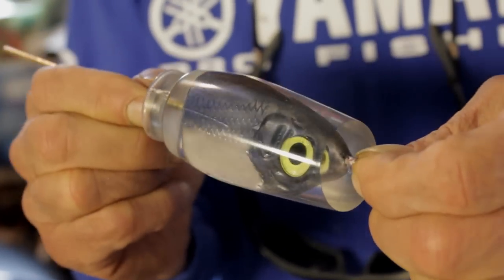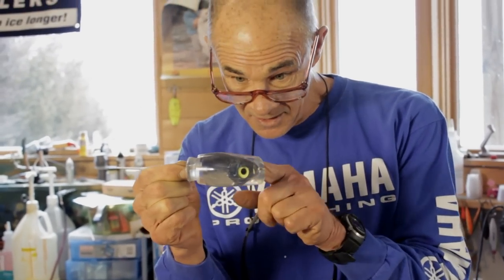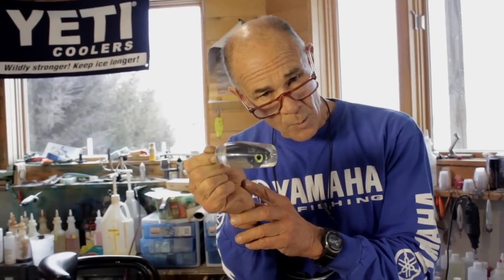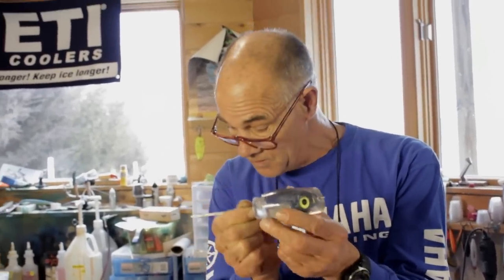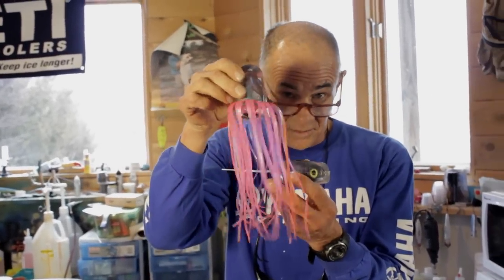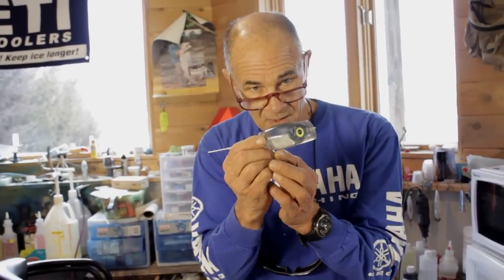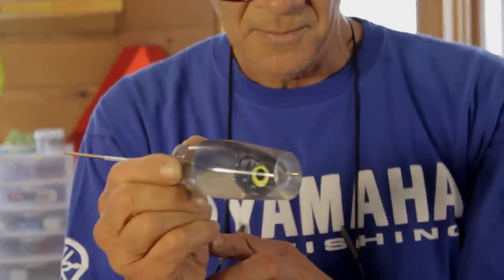There it is. As you can see, this technique makes an absolutely beautiful head with very little muss or fuss, and as any marlin fisherman would know, this one I poured upside down because they really run this way for marlin. But it doesn't take much imagination to think about how to go beyond marlin with this. You could change the head shape and make it wander or vibrate, change the balance, put a skirt and a soft plastic tail, a flip-flop, or a wiggler. Depending on balance and weight, you can make this thing do almost anything from popping on the surface to running deep underneath.